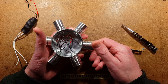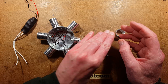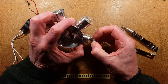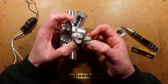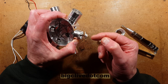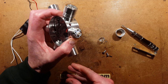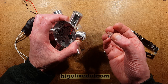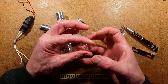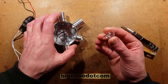Let's unscrew one of the heads and show you. If you unscrew this part - it's the very common approach to these lights, but with a slight twist. It's got standard Luxeon-type LEDs. If I pull this off... actually it's different to what I was expecting, and that's even better. It's got a flat surface for the LED heatsink compound, and the wires have a channel going underneath to allow easy routing. That is a nice feature. We've got the classic collimating lens that sits on the end - though it's clear with no metallisation, it gathers all the light by refractive index differences and fires it out the front. It's a really common type of lensing system for these LEDs.